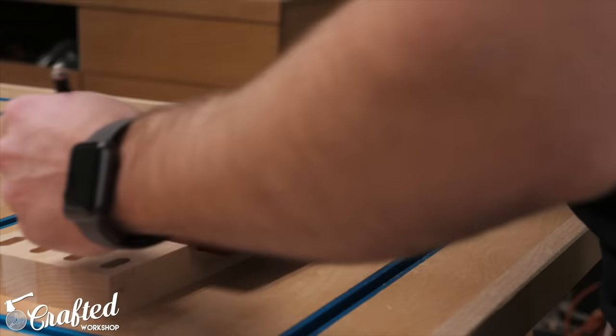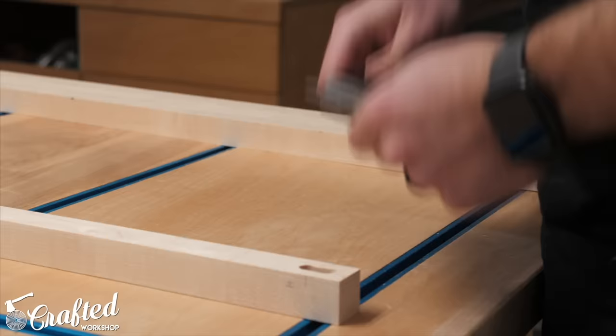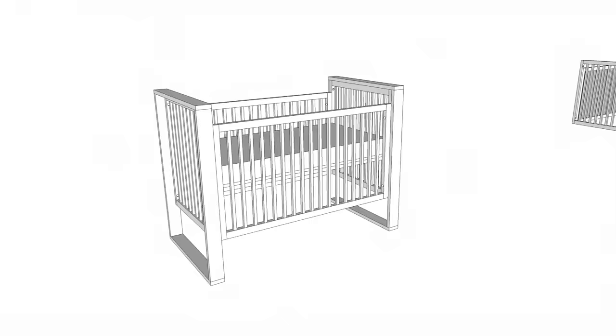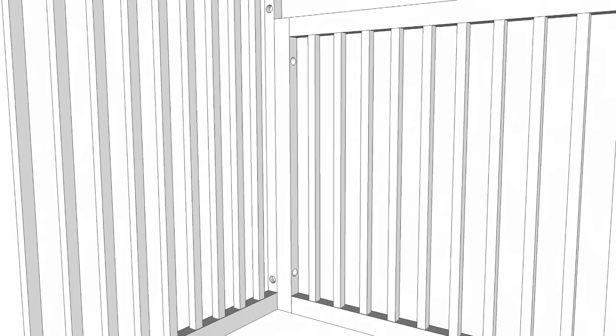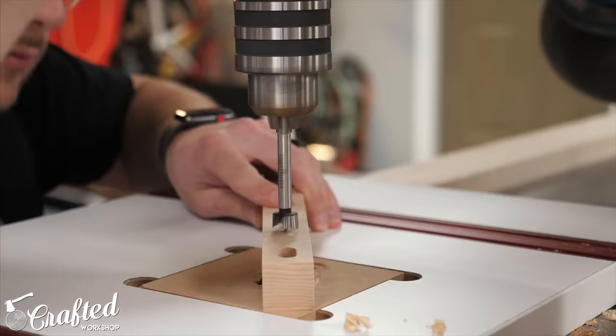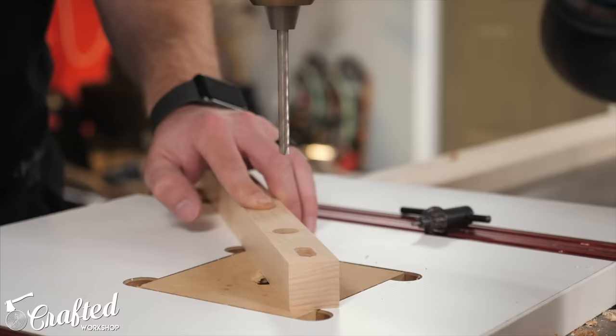Before gluing the side rails onto the top and bottom rails, I needed to drill the holes for the bolts which will hold the crib together. Most cribs are too large to fit through standard doorways, so it's really important to make cribs easy to take apart and put back together. The sides of the crib are attached to the head and footboard sections, which are then attached to the legs. I'm using quarter-20 stainless steel bolts and tapping the wood to accept the bolts. I drilled a recessed hole for the bolt head using a three-quarter-inch Forstner bit — these holes were half an inch deep. Then I swapped to a drill bit sized for the bolt to drop through snugly and drilled a through hole. The Forstner bit leaves a center mark, so it's easy to center your through hole within the recess.